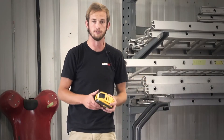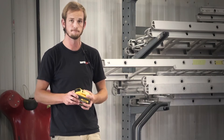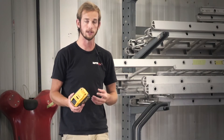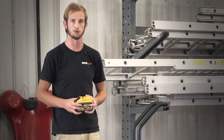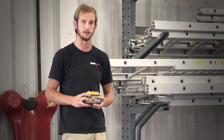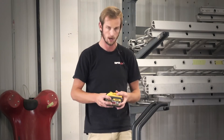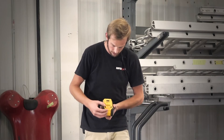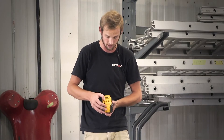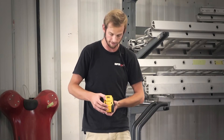If your batteries are damaged either from a drop, some kind of shock, or an overheat incident, they should be disposed of properly. Do not continue to use damaged batteries. We've all seen the news reports of fires from lithium-ion batteries — they're very hard to control, usually at unexpected times. So if you do see any kind of deep gouges in the plastic, or any kind of burning or disfigurement from overheating, they should be replaced immediately.